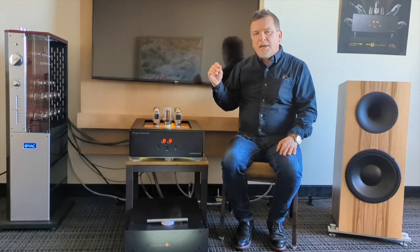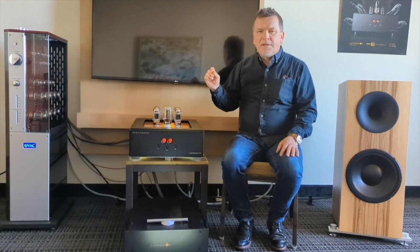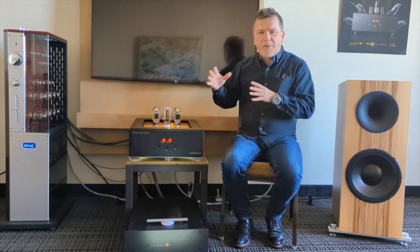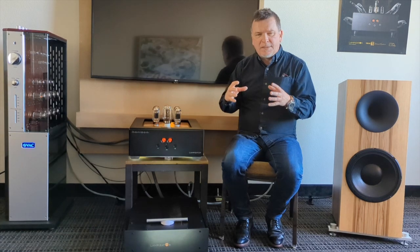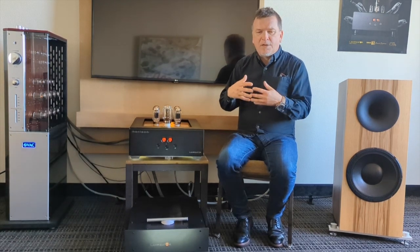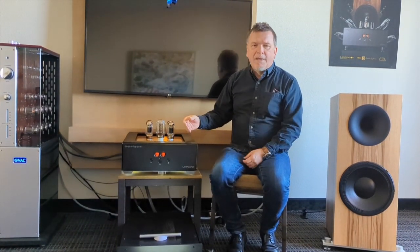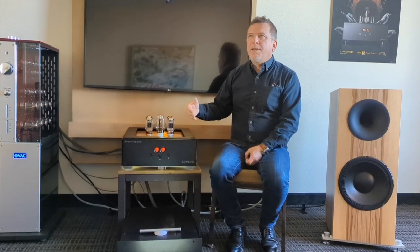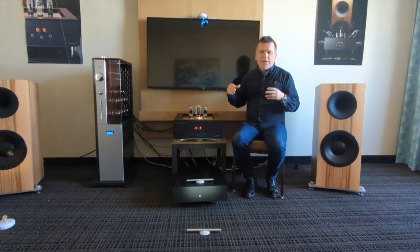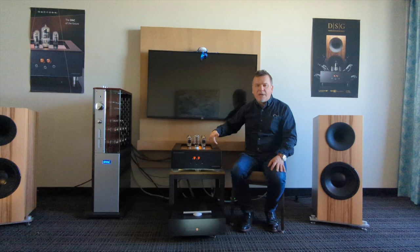The precision in our system is 0.01 millimeter, so 1/100 of a millimeter, which is about a quarter of the thickness of a human hair. That's the precision, or the grid, on which we operate while moving every component and trying to put them together and see if they fit. And they do fit, so at the end there are no surprises, everything must fit, and there are no collisions between a capacitor and another capacitor or a tube and a chassis. This precision allows us to build things in a virtual world, and then we can even rotate it in 3 dimensions and see where the ventilation is, and at every given moment we can see the weight of the product depending on how much aluminum we extract by routing.